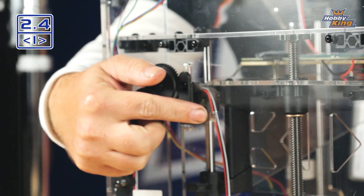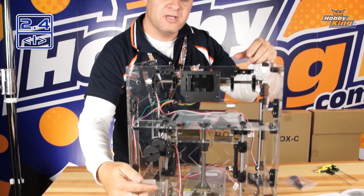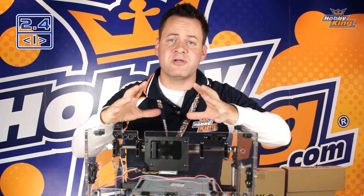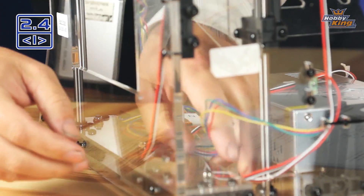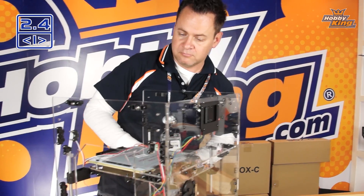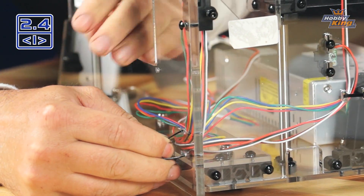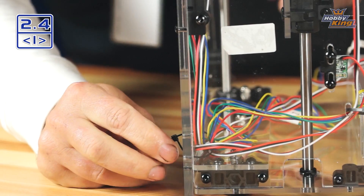There's also a zip tie slot right in here, but I'm not going to install a zip tie there right now because a wiring loom is going to come down along here and go into this hole later. We're basically trying to loosely get this wiring in place so that once everything is buttoned together we can go in with zip ties, get it all secured, and ensure the wires are out of the way and running in their approximate correct positions. I'll grab another zip tie, run these through, and just a couple clicks — nice and loose.